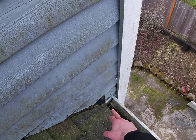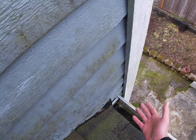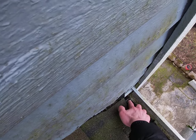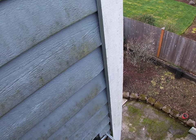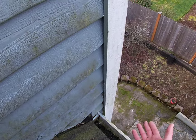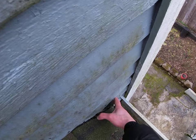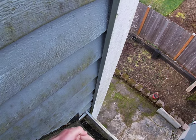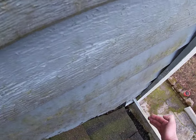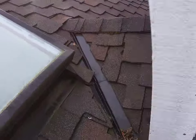But the problem here is we don't have this kick-out flashing. So what's going to happen? The water is going to come down and go right here — you can predict water's direction. This area is exposed to water, and in the long term this can damage your wood, increase the chance of wood rot, and ruin those areas. So it's good to have something like this — imagine a piece coming back here, it's just going to cover that area. When water hits this flashing, it goes directly this way, not that way. So it's good to have kick-out flashing in those areas.